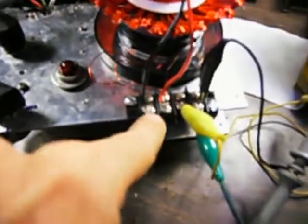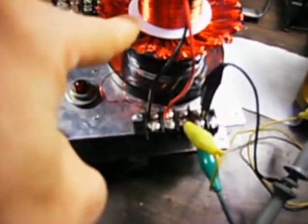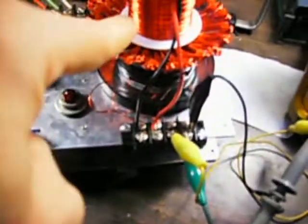That's about 150 ohms ohmic resistance worth of 34 gauge wrapped on the bottom of that spool there, and then I just filled the rest of the spool with 22. So here are the terminals for our 34. Here are the terminals for our 22. Now it is in series, or parallel, depending on your perspective. Either one doesn't matter.